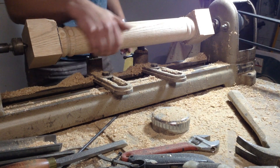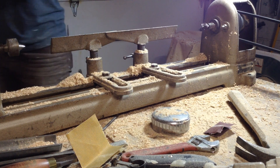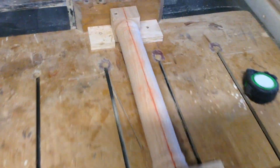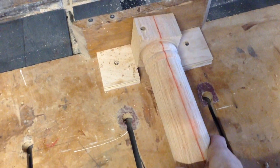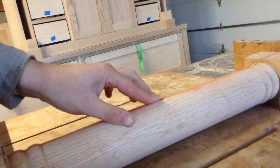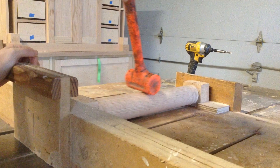I take this out of the lathe and cut off these two excess edges. To make two of these, I decided to turn them as one 3D circle and then split them down the middle. The problem is these columns weren't entirely square when I started. So I put two cleats on either side of the pieces — the cleats are adjustable — and drew a chalk mark on the top and bottom. I could send it through the table saw with the blade risen just a bit to make a slight kerf. I already had a miscut on the bottom and had to adjust, but then I could see the kerf lined up with my marks and started sending this through.